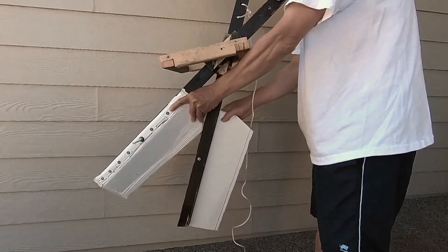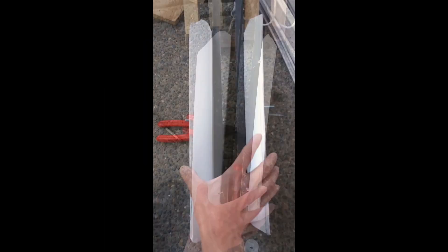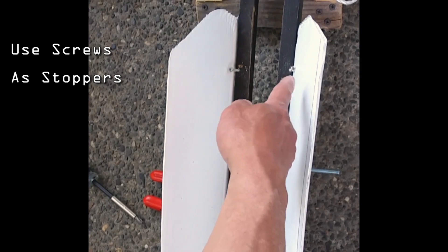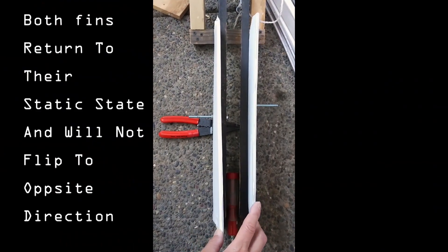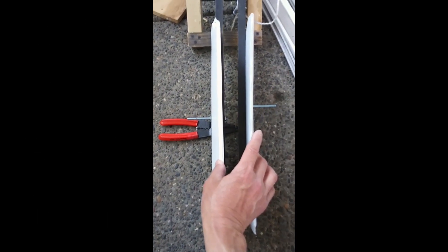In my first design, I had the fins overlapping issue. The right fin worked well, but the left one sometimes flipped in the opposite direction and jammed the right pedal. I believe I can fix that problem by adding stoppers to prevent that from happening again. I also modified the hinge of the fin so it will not have so much freedom of movement.